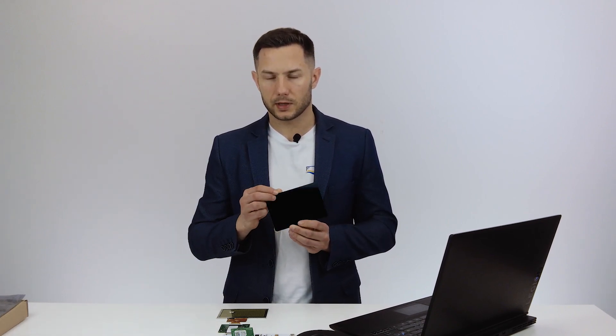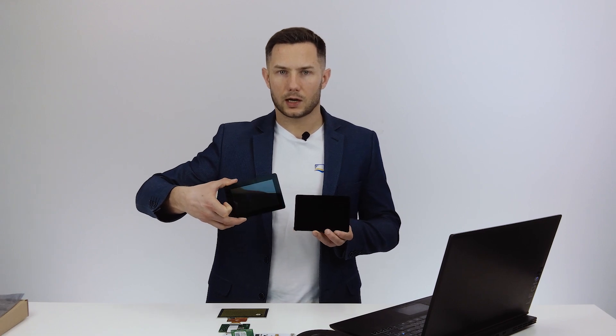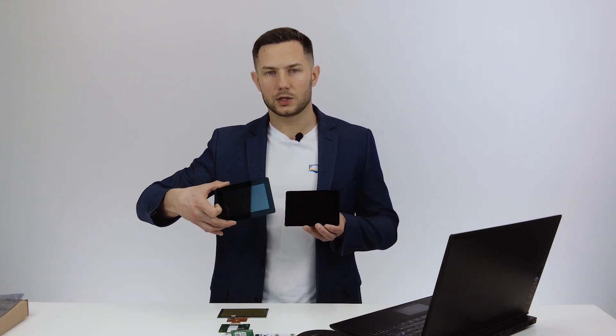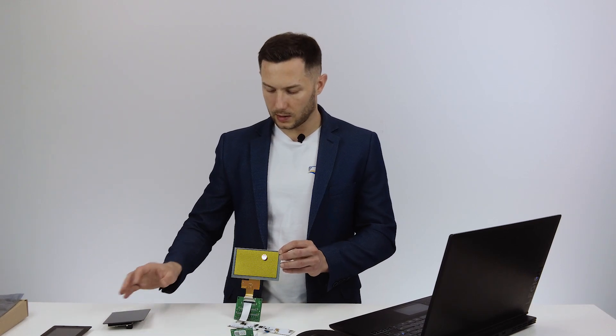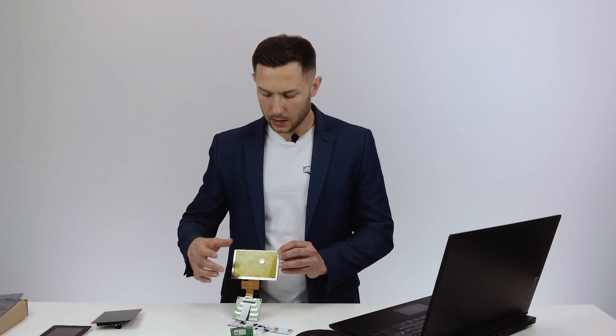It's a perfect display for indoor and outdoor solutions. When you buy a RiverD display, you receive not only an industrial grade display, but also all available options right away from stock. One option is the touch screen. Here I have an example of the 5-inch display with an optically bonded touch screen, which is the recommended bonding method because it removes all reflections and gives brighter, more vivid colors. Here is another 5-inch — this one looks more grayish and reflects some light because it is air bonded, which is a little cheaper. The optically bonded version is recommended for most applications. You can also buy a version where the touch is the same size as the display, without the frame.